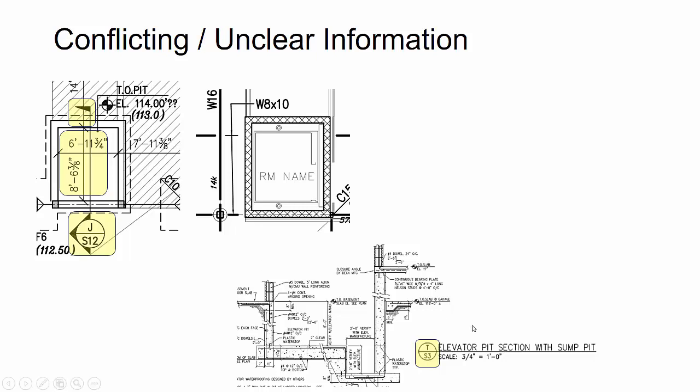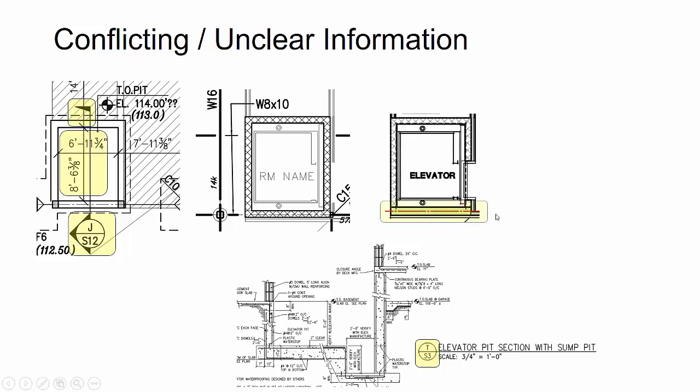So you'll see that there's this elevated cast-in-place concrete wall, and then over here on the other side of the elevator shaft, it's shorter and only goes to the 118 foot. But over here, you can see that the wall goes to the 129 foot at the first floor. So when I started studying that and saw that the section looked like it might be backwards, the architecturals show that there's this thicker cast-in-place wall, which I think is this one. And when I compared it to the foundation plan, I was like, okay, looks like this wall goes higher than the rest.